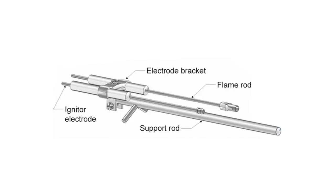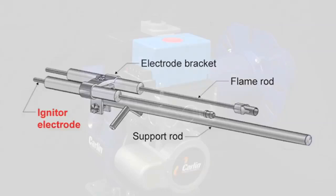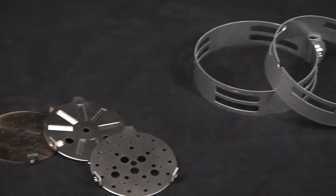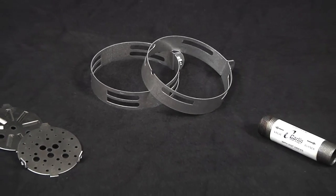The EZGAS Pro features a durable, single-pole, 9,000-volt igniter, and a proprietary safety control for flame rectification. The diffuser plate, air band, and the gas orifice equipped on the burner determine the firing rate.